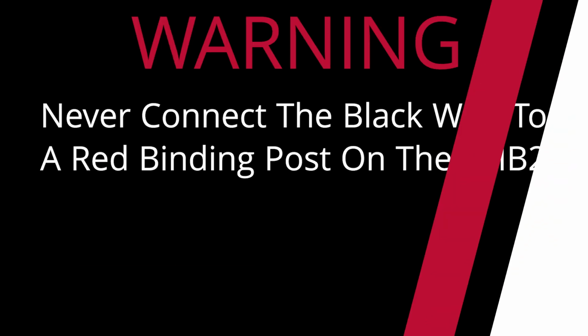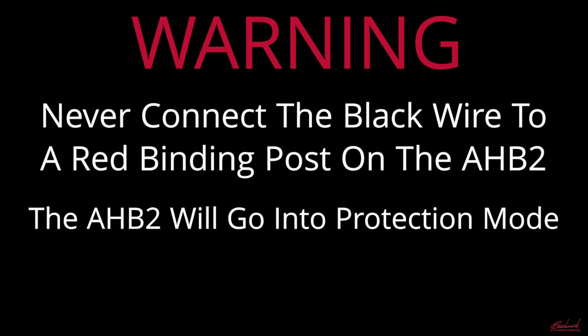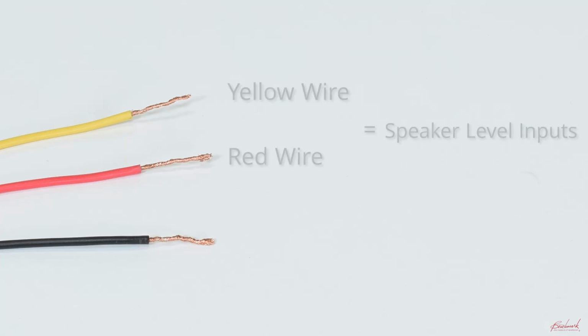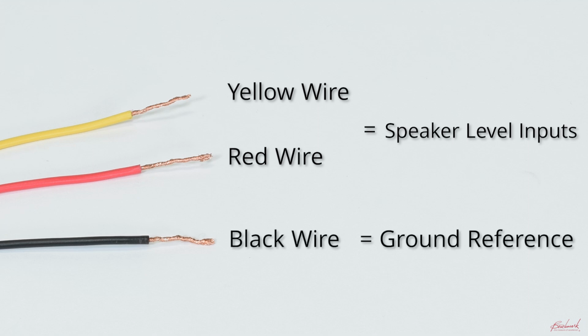AHB2. Now here's an important safety tip before we get started. Never connect the black wire to a red binding post on the AHB2. This will short the output of the AHB2 ground and put it into protection mode, and it could also lead to damage in the REL subwoofer. The yellow and red wires deliver speaker level inputs to the REL, but draw no power from the amplifier. And the black wire is a signal ground reference for the speaker inputs. The yellow and red inputs are then summed together in the REL.